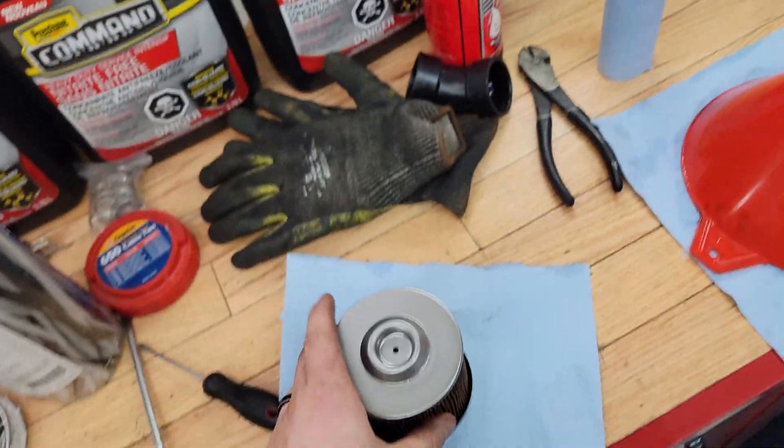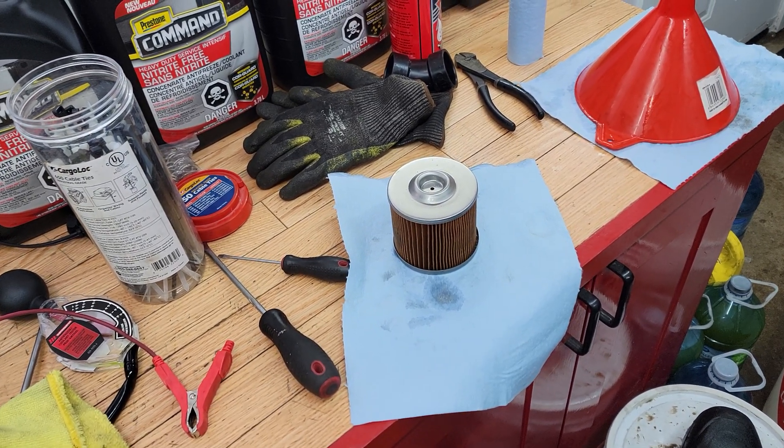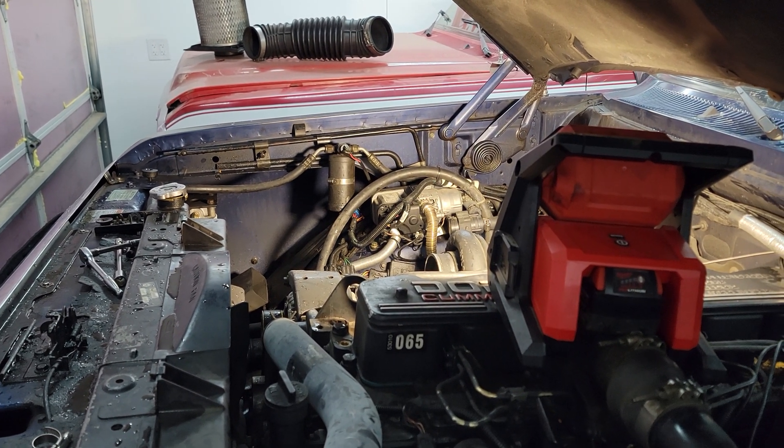Now that I have a new filter on there, I'll run it for about 10,000 to 15,000 kilometers and then change again — we'll see how it is then. Doing a flush does knock some gunk loose and clean up the system a little bit. I'll do another update video in a year on the next coolant filter swap, about 10,000 kilometers, and we'll see what sort of debris we get. Hopefully this video helped — if you're looking to change the coolant in your Cummins truck regardless of generation, make sure it meets the Cummins engine standard CES 14603 and you'll be worry-free for years to come. Thanks for watching and cheers.